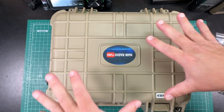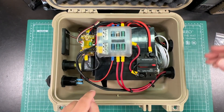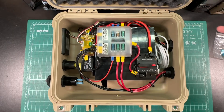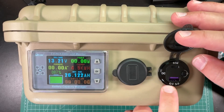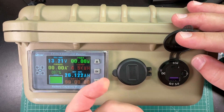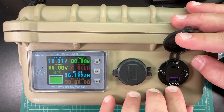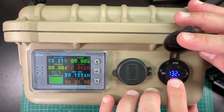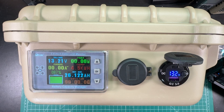Now I'm with the USB outlet here. Just to bring you up to speed, let me show you what's inside here. This is a battery box that I built, and inside is a 30-amp-hour lithium iron phosphate battery. In all my boxes, I use lithium iron phosphate. Our voltage is 13.2 volts — here's the meter here. We've got a 65-watt USB-C PD and a USB QC 3.0. We push this little button, we have a voltage meter, and this thing is really cool.